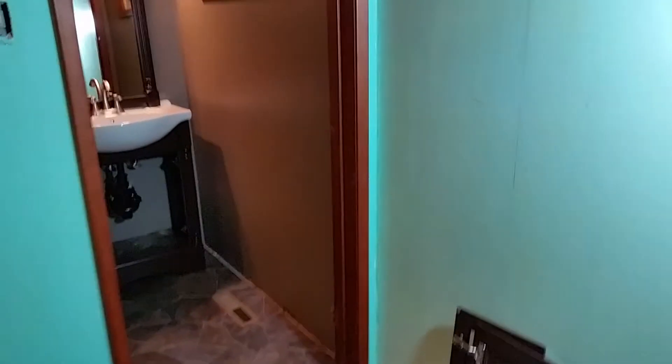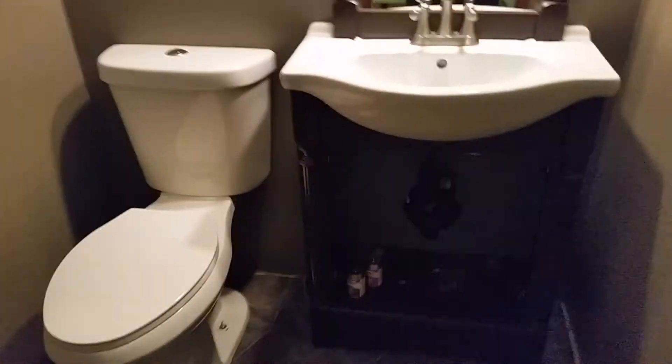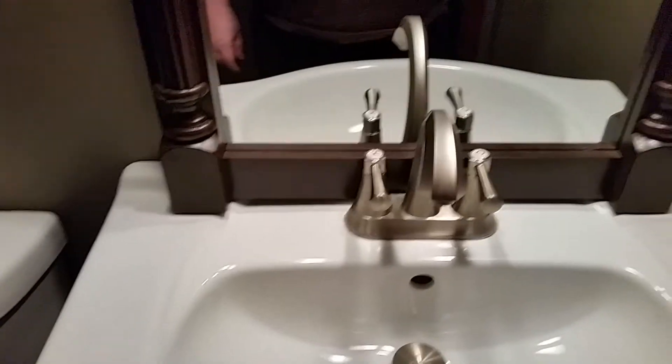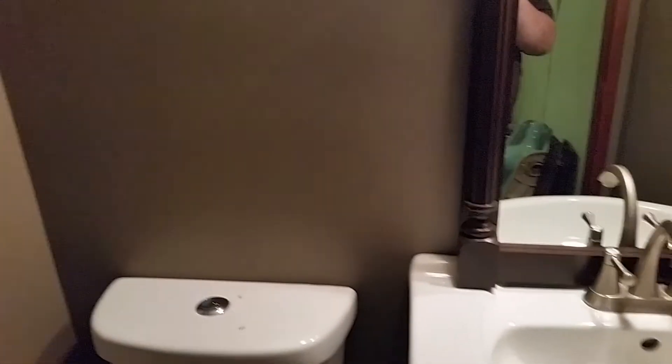Getting there — it's just a matter of gluing the P-trap, putting the doors back on, and that's done. The taps are hooked up, water's hooked up, I just haven't turned them on. So all that's left is: glue and attach the P-trap, put the doors back on, put the mirror on, either raise the light or change the light, baseboards, threshold plate, towel bar, and toilet paper holder — and we're done.